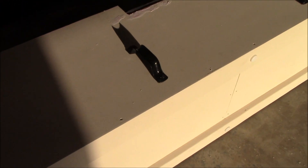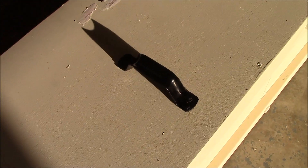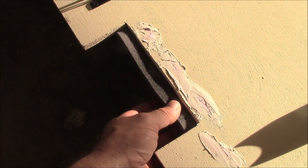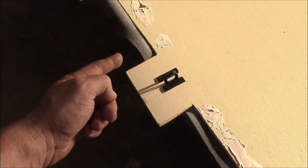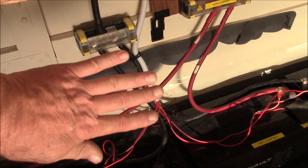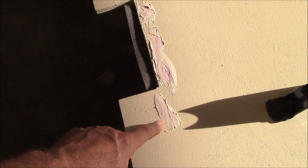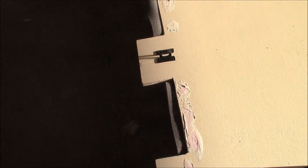Now with the handles, these are gate handles that had wood screws and I put quarter-20s in here with lock nuts. With the foam back here, I'll show you how I got this thing sealed up. This is that air conditioner foam stuff you can buy at Walmart, and I stapled it in two places — on the front and a piece back here so it mates up together for a good seal. The staple gun I used was just a hair too long and came through the wood, so I had to sand them down, fill, and touch up the paint.